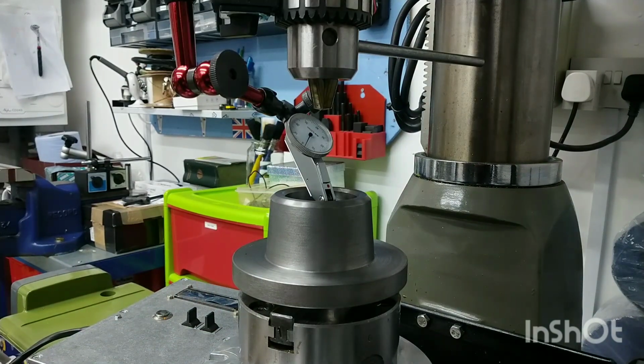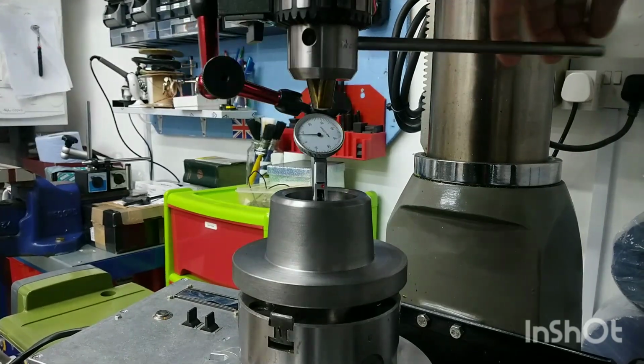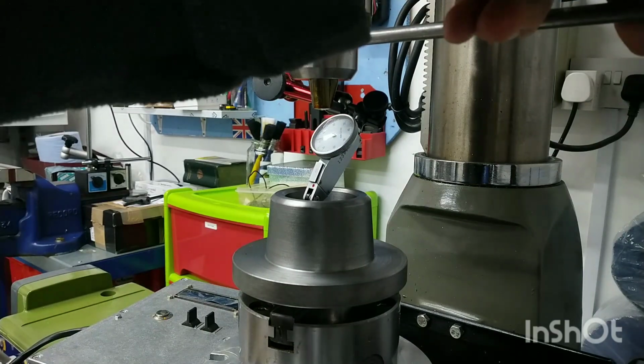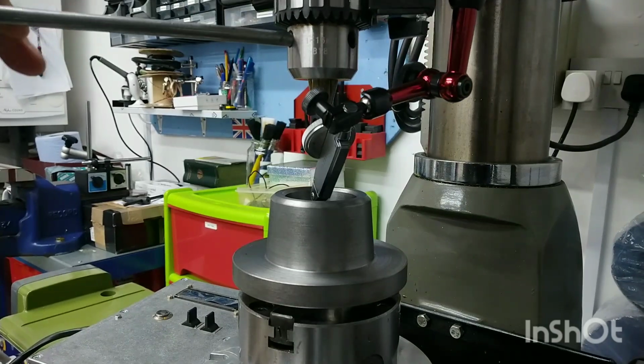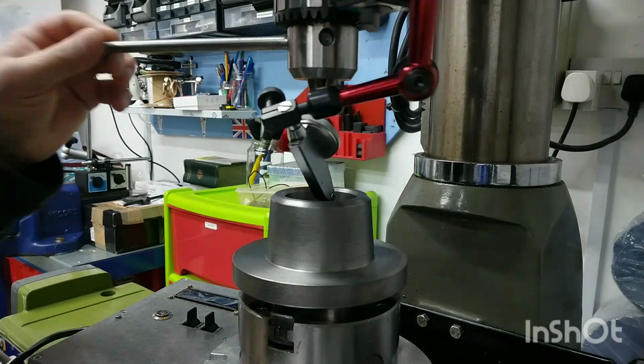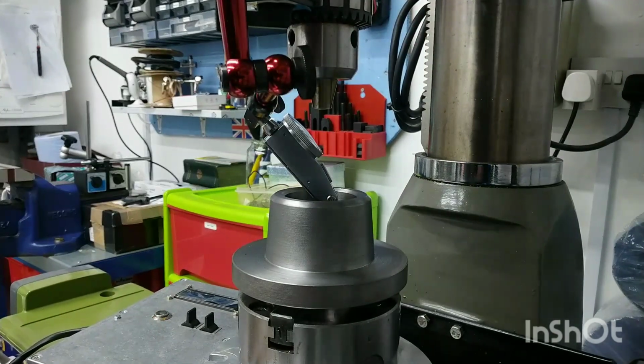Okay, so I've got the machine spindle lined up over the top of the rotary table and the component now. Everything's coaxial to within, I would say, at least 5 tenths. I've actually got to the point where I'm inside the envelope of the chuck run out. So it's not looking too bad at the moment. It's pretty good actually. And yes, I know I really do need to either make or obtain a better way of doing this. But this has worked anyway, without too much faff.